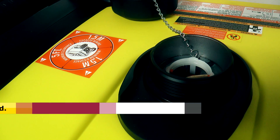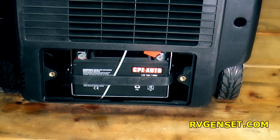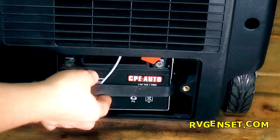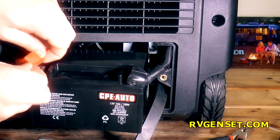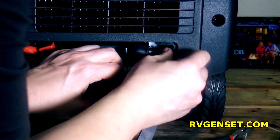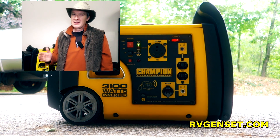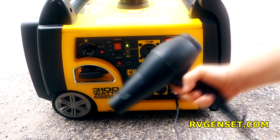It takes about 19 ounces. You fill it up with fresh gasoline, connect the battery — and that's probably the trickiest part. You have to undo a little service panel on one end of the generator. Inside, the battery is held in place by a rubber strap. Cut a couple of zip ties, attach the battery cables, and you're set up for your break-in period. Run the generator for five hours under variable load, less than 50 percent.